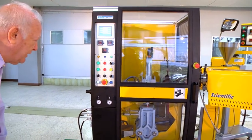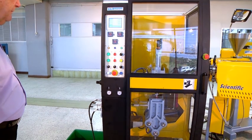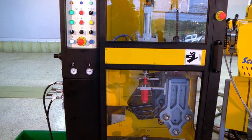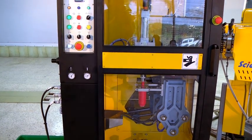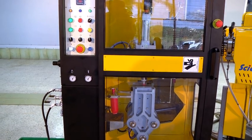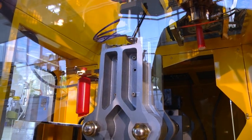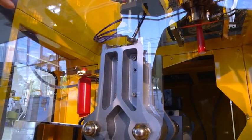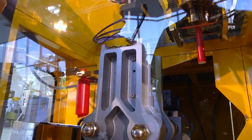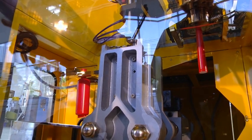So we're just cooling now. Release the air pressure, mold opens, mold goes up to collect that extruding parison, cut, come down again, and the cycle is repeated. So at this stage, the blow pin has gone down into the mold, into the parison, blowing the parison into a bubble. At the same time, parison is continuing to extrude, and the previously blown bubble is cooling on this support here.